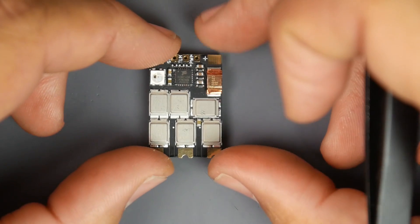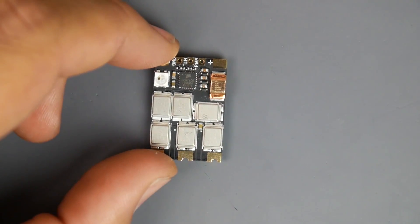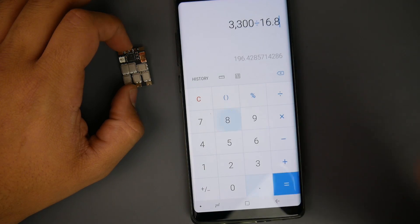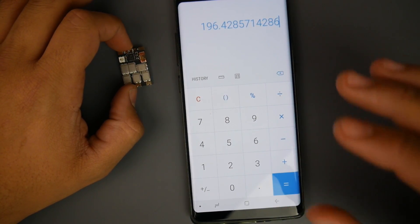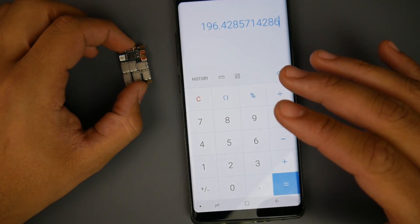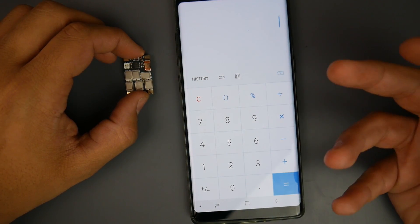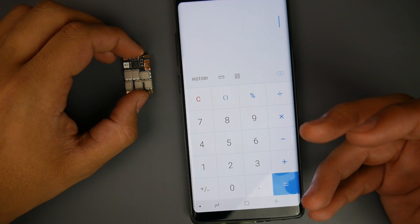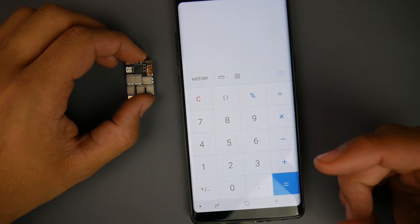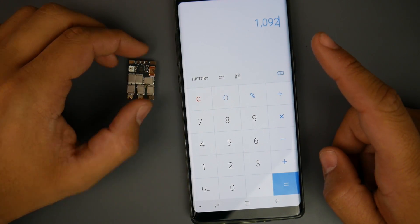Now the FETs are theoretically rated for 3,300 watts, which is quite a lot — around 330 amps at 10 volts. On a 4S LiPo, that's capable of around 200 amps if you keep the temperature down. This is a theoretical rating — it could handle that amount of current if you keep the temperature below 150 degrees Celsius, or more likely below 140 degrees Celsius. Holybro's own test was done at 4S pulling 65 amps with nothing covering it for one minute, and it survived just fine. That's 16.8V × 65A = 1092 watts of power for one minute without any issues or degradation.